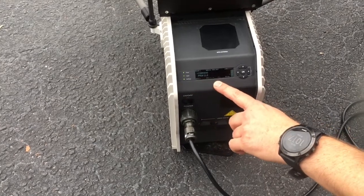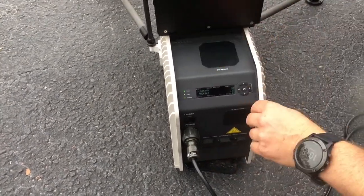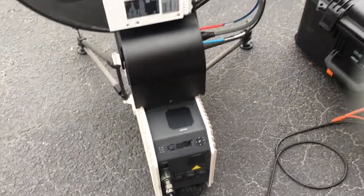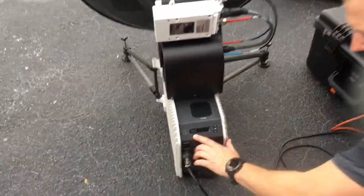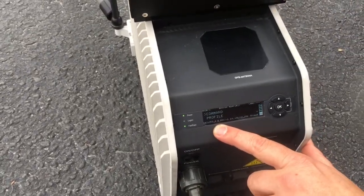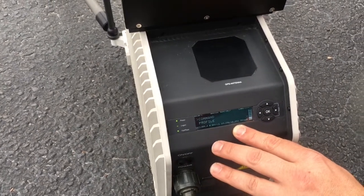Right now it's lined out, but as soon as we know our GPS we'll see the correct satellite pop up for the region of the world that you're in. You'll see the transmit and receive frequencies and it'll initialize the acquisition. Now we've got it — found out that it's in the US and it's going to go to 55 West. It's got its homing frequency so it's going to start the acquisition process.